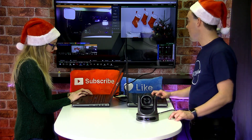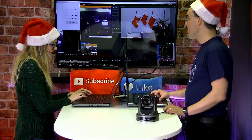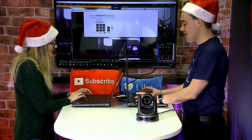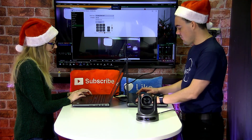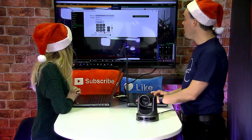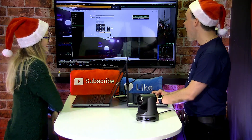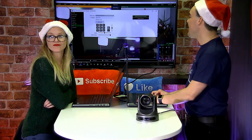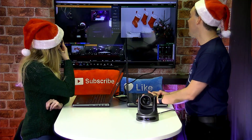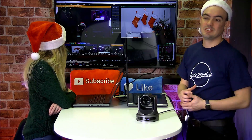The great part about it is I can still control it over IP. I'll go ahead to PTZOptics, type in the IP 192.168.1.58, connect. So I can still control this camera over the network. And I can also control it over NDI as well. Something we're going to be talking about more in the coming months, but that is the new NDI camera. Just wanted to show it off.